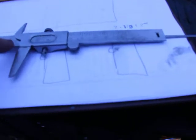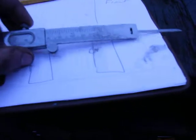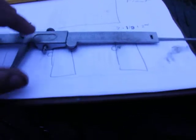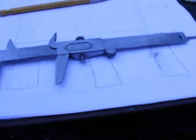It's not going to zoom in. But so the normal, if you will, part. It's just a ruler, and it's called the main scale. But on this little window here, there's a smaller scale, and the bottom it's centimeters. The top it's inches. But on mine, it's only 8 divisions for the inches, and it's got 10 divisions for the millimeter. But both of them are still 9/10.